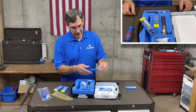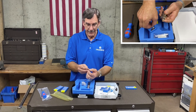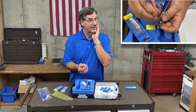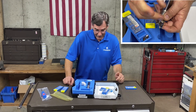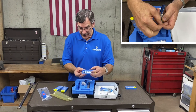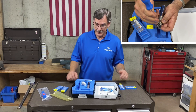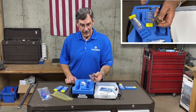When it comes to machining aluminum, you need an insert with a much more radical chip breaker and a very sharp cutting edge. I know you can't see this on the camera, but this is so sharp I could probably shave with it. It's extremely sharp compared to other inserts for harder materials. You can see the high polish on there which makes it very slippery. It's carbide, which is a slippery material, and the high polish makes it even more slippery so that the aluminum doesn't weld itself to the insert — making it an excellent tool for machining aluminum.